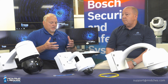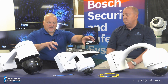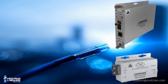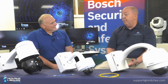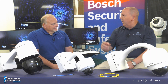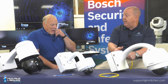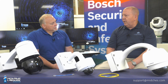One of the big questions that some people are going to ask is: when do we use a fiber optic transmitter built into these devices versus a standalone media converter? I think there are a couple of different options and no right or wrong way. But you talked about lightning and surge and high voltage — say a light pole where power comes up to a light at the top. You really need the fiber optic media converter as close to the camera as possible to eliminate those problems. The closer you can get the media converter to the camera, the better off it is.